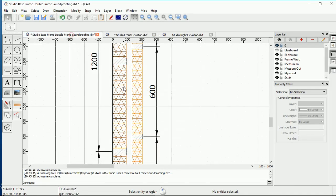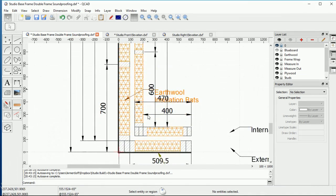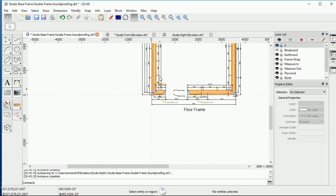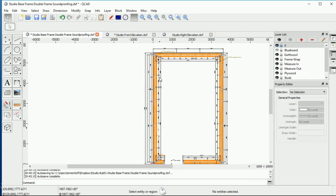And if we look at the plywood down here, as you can see, there's my plywood there. Behind the plywood, again, there's still insulation. I'm also using 4 stud corners to make it not only a solid frame corner, but at the same time so that it's really stable and there's no air gaps. It's all filled in. So yeah, that's about it. That's how far I am.